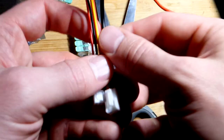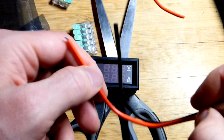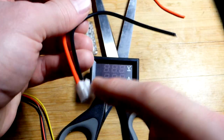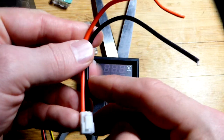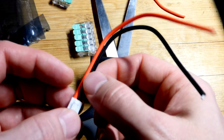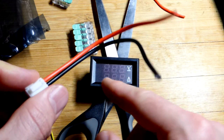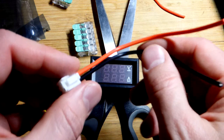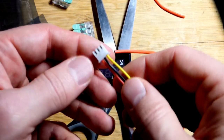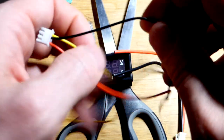We've got two pairs of wires. This red one is for the load — you need to limit the current coming to it and the meter will measure it. The black one is a path for that current to go to ground, but it's also ground for voltage measurements and for powering this unit if you're only using one power supply. Be aware: if you're just using one power supply, you don't use this black wire right here.